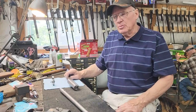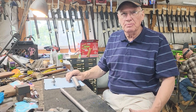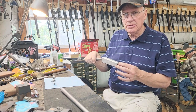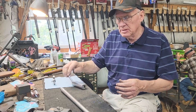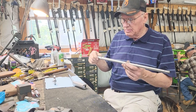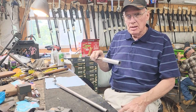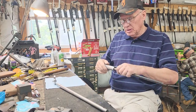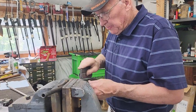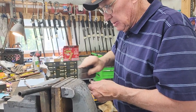We've been back to the bead blast cabinet where we used a real fine BT13 glass bead. We've bead blasted the rust off this poor old gun and it is pitted just like I thought it was going to be, all over — something terrible. It's probably going to lose some lettering on the barrel, but we can always touch up lettering by hand, just like the engraving will be done by hand. We're going to get it in the vise now and get some polish work started to get that pitting out. I assure you it'll be pretty void of engraving because this pitting goes quite deep.